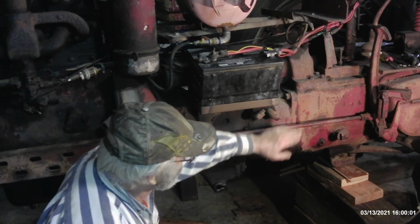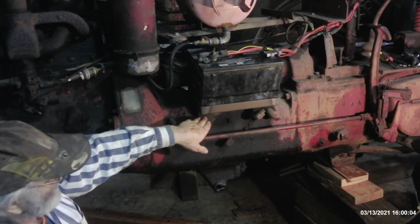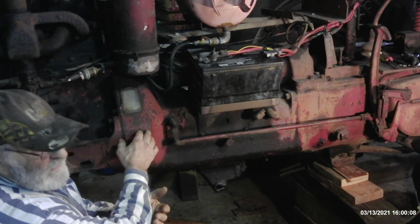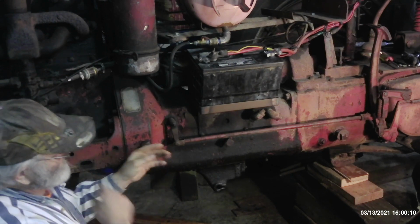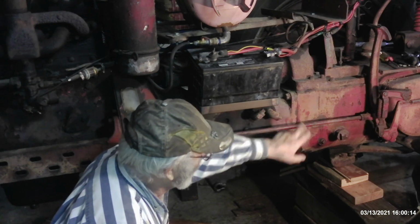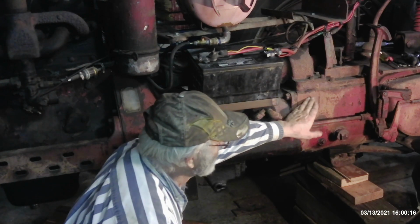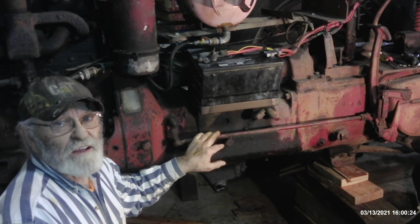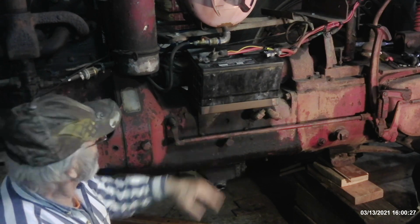At the same time, directly above it, you have an input shaft to the transmission that is connected via the clutch directly to the crankshaft of the engine. That seal right there is also leaking. So I've got a pair of seals, one on top of each other, in the leading portion of this that I'm going to have to gain access to in order to change out. Massey Harrises I don't have a problem with, but this will be the first time I've gotten into these.